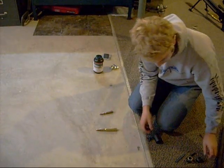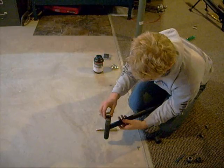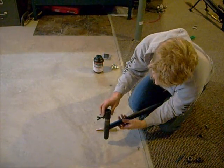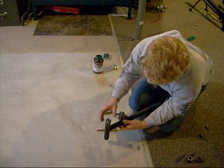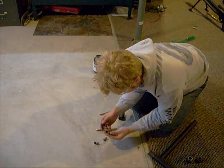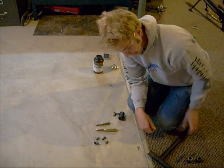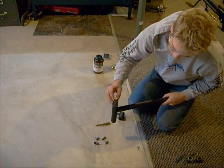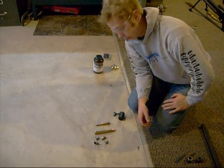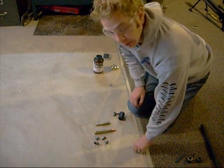It's a good way to pull bullets if you know you're not dealing with explosive tip or incendiary tips. This was made in probably an hour in my shop with nothing more than a bench grinder, a hand grinder, a drill press, and a vise. It was mostly fine tuning — cutting these collets in half with a hacksaw, same with the nut. It seems to work great. It'll take you a bit of fiddling to get this groove just the right width to fit in all your shells — try a few different shells. Make sure this is long enough for the bullet to exit the shell completely, and make it sturdy because you're putting some good swings into it. Anyway, there's a kinetic bullet puller for a .50 cal, modified for .338 Lapua — not a very complicated idea. Be safe, think about what you're doing, and don't hurt yourself.